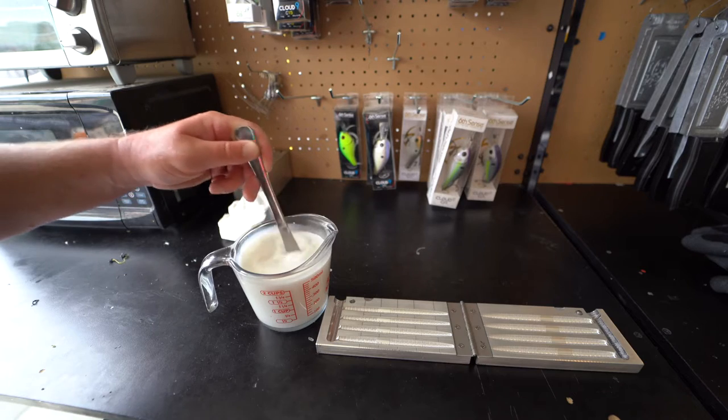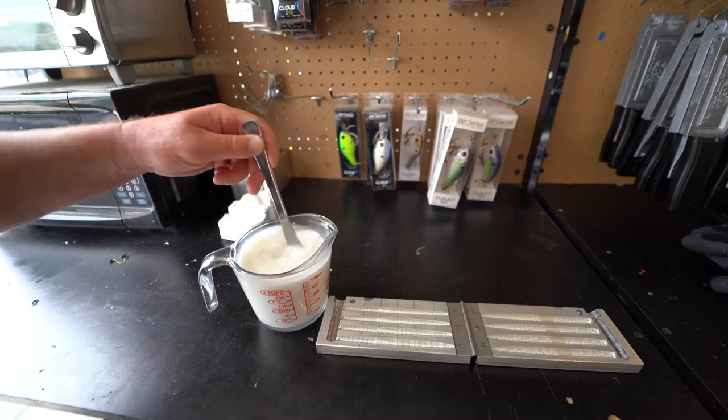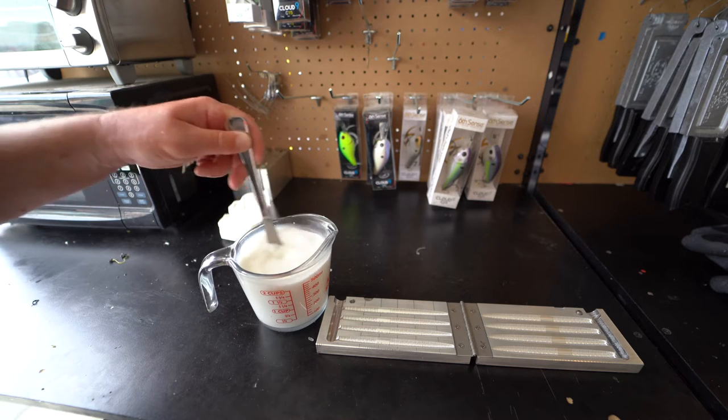When you're warming up your plastisol, you want to take it slow because you can burn it. What I like to do is when it's fresh out of the container before I've heated it up at all, I go one minute increments until it starts to thicken up slightly. Then I go into 30 second intervals because that prevents me from burning the plastisol.